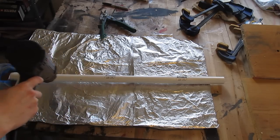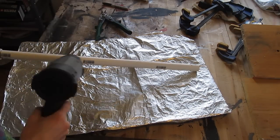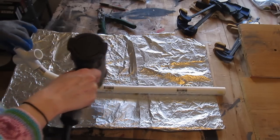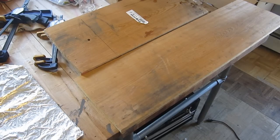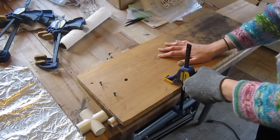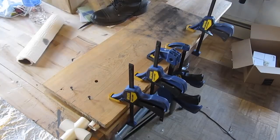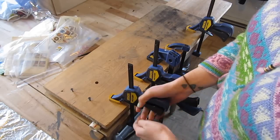Go ahead and put the heat gun on it. You're going to get a feel for it — it took us about 15 minutes. Just take your time, heat it up evenly, and you'll see how it softens. Keep spreading that heat around — see how soft it's getting. You can feel it to check which spots still need heating, but make sure you wear safety gloves. A heat gun is not a hair dryer — it gets hotter, so be careful. Once it's all heated up, put it between two pieces of wood and clamp it down. You don't want to clamp the final inch — you want that to stay round. Then go ahead and step on it, really press it down. The more weight you get on it, the flatter it will be.